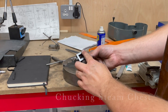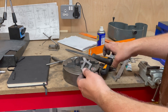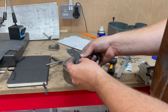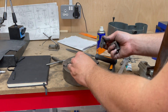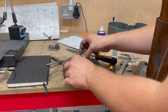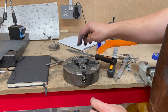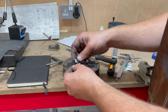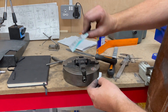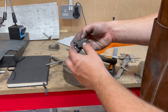I faced off both sides of the steam chest in the four jaw. I'm using some parallels that I've recently purchased — unfortunately made in China, but couldn't find any made locally — which are excellent. Half inch is just right to get this in here. I'm using old beer cans chopped up as shims to avoid marking the surfaces too badly.